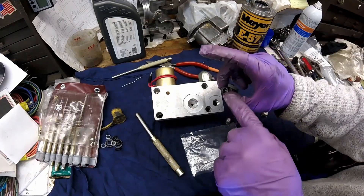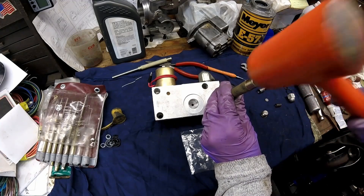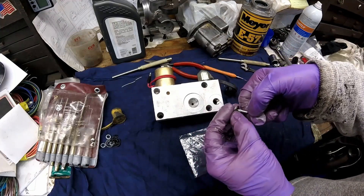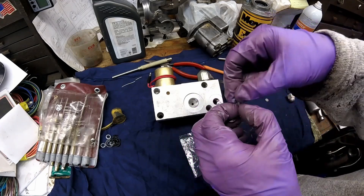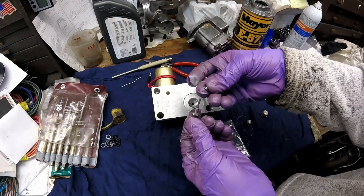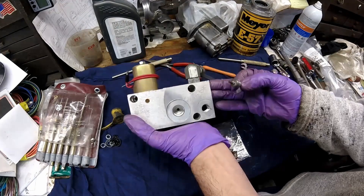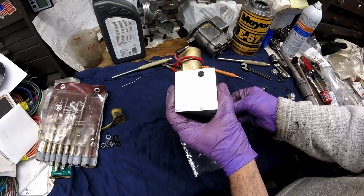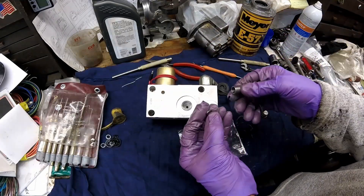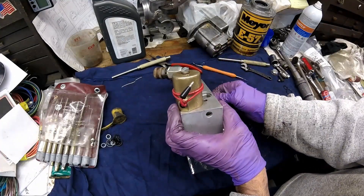Now I install this lower valve part in with the O-ring already in it. I just give it a light tap with a rubber mallet to make sure it's all the way down — you can hear it right there that it's all the way down. Then this goes through it all. You can see the Teflon ring I put on there — it comes in the kit. That face is down, so it goes like this. Put the sleeve keeper on, and you put the lower spring retainer — it faces up also like that. You put the sleeve keeper on. This drops down into that piece we already installed. This one gets the longest and the thickest spring. Put this adjuster piece up inside, and just put this on and screw it in.